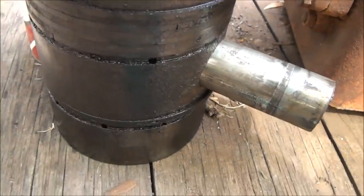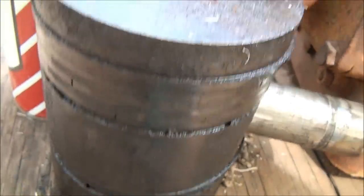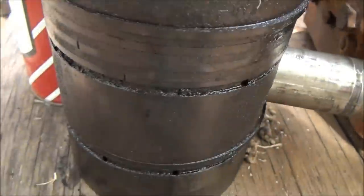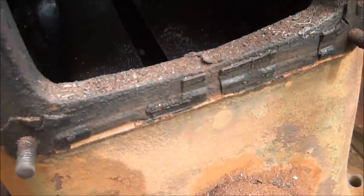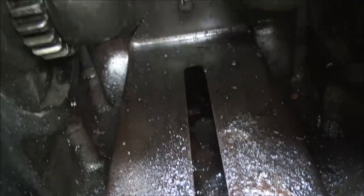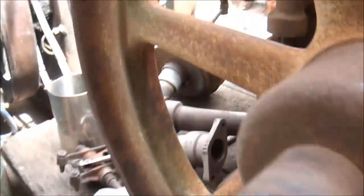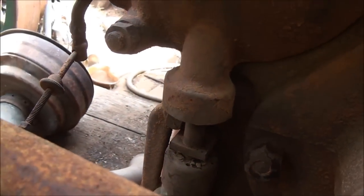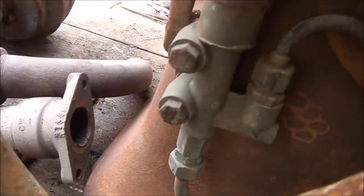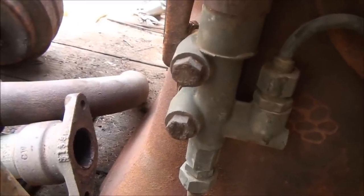The piston here - just a matter of digging out the old rings from the grooves and cleaning them up, but the piston looks pretty sound. The crankcase needs a good clean out to get rid of all the muck. I'll pull the oil pump off - it seems to move okay but it'll come off. It has a couple of little check valves with ball bearings in there that just need to be cleaned out - probably got a lot of old oil in there that needs to be removed.